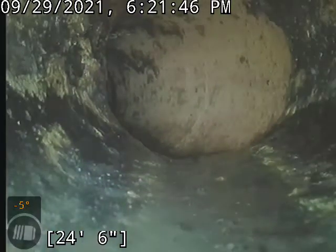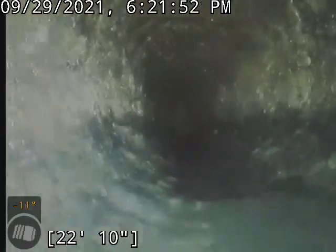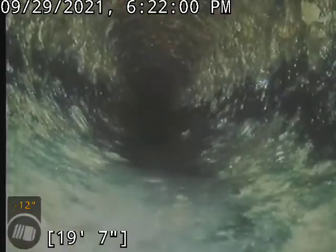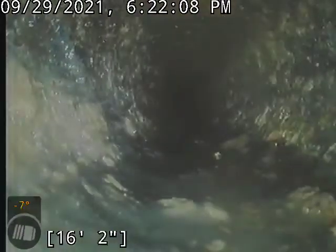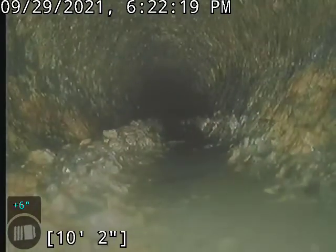So now this is the portion that we did a d-scale. It was really bumpy, really scaly — that's what was catching a lot of soft toilet paper and everything, creating a blockage. We smoothed it as much as we can, ran it forward and backwards in the line. You can still see that scale right there on the bottom — that's all loose. We'll try to run water again.